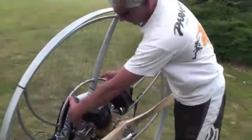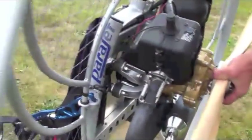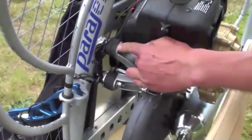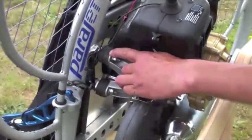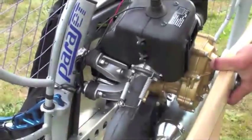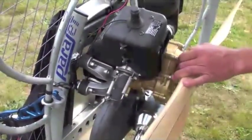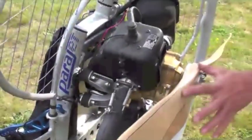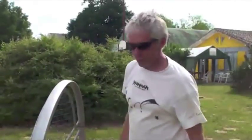Moving from the cylinder to the back of the engine — most engines are mounted at four points, all with rubber mountings. We need to check the integrity of these; they're just a rubber block with metal discs glued on. The whole engine is effectively hanging from a glued spacer on a rubber block, and they have to take all the weight of the engine plus all the forces and vibrations from a spinning propeller. Check the integrity of the engine mounts and that they're secured by their locking nuts. And there we have worked from the engine through to the chassis, having already checked the chassis, and previously the harness. Should take about three or four minutes to do all that.